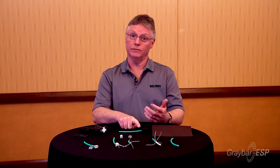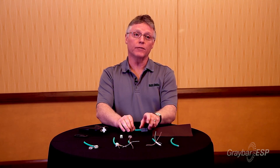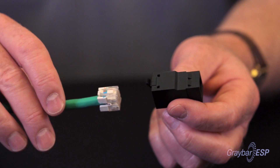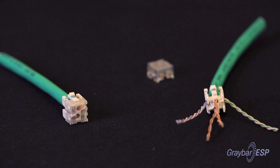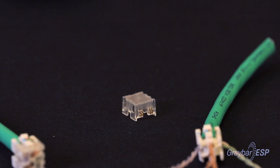This is what the final product looks like. In essence, what we have is a cable that's inserted into a jack. When I remove the cable from that jack, I now have what we call the core. This core consists of cable, a cable management bar, and a contact — a cap. On that cap, we have gold-plated piercing contacts. Those piercing contacts result in a much better yield on terminations. This piercing contact technology will result in less than 1% initial failures, which from an installation standpoint means that the technician will not have to do reworks and re-terminations.